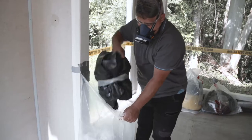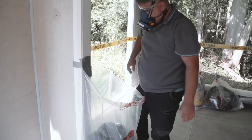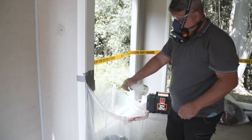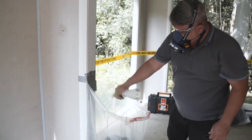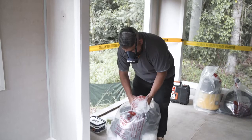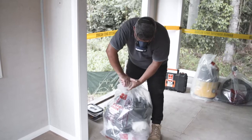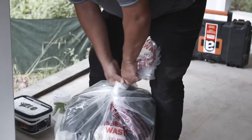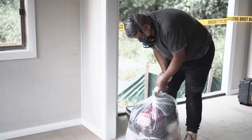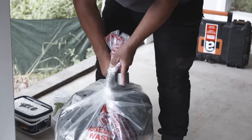Only fill the waste bags half full — use another waste bag if there is not enough room. RPE must still be worn. Use the spray bottle to spray the inside of the waste bag and the internal sides. Now twist the neck of the waste bag about 1.5 turns and gently squeeze air from the bag through the twisted neck, eliminating dust coming from the bag. Continue to twist, goose-necking the bag into a tight neck. Now tape around the neck of the bag several times with duct tape.